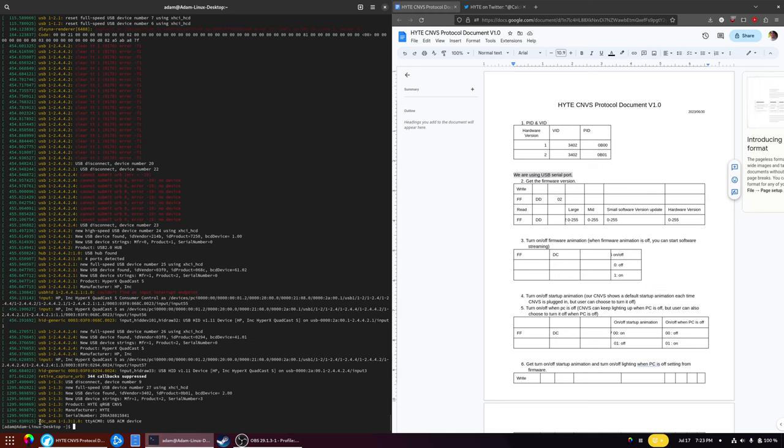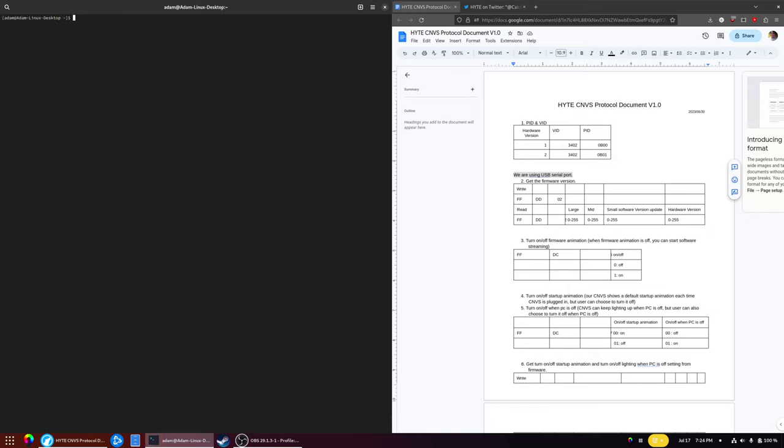it says here it's loaded the CDC ACM module, and it said ttyACM0, a USB ACM device. This is a USB serial port essentially. Arduinos also use ttyACM on Linux. So we can try to do some things. So first of all,